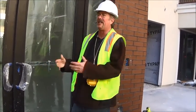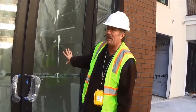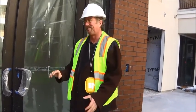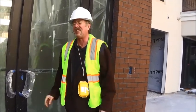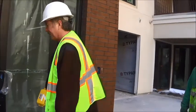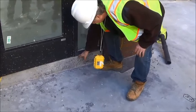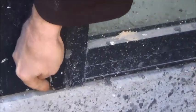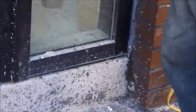If they turn around and tell us later, we're going to use somebody else, then what happens is you've got to put Tremco epoxy primer over the hot rubber and sand it, just so they don't have a problem. But we don't have to draw that. That's their issue. Stop your hot and you're out of here, it's their issue. It's not ours. Another problem is the hot can't get under here. Chances are there's going to be a sealant coming around from the inside on the threshold plate coming out like this. So we need to make sure that that sealant's compatible with the hot rubberized membrane.